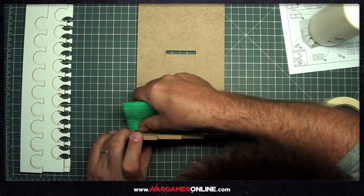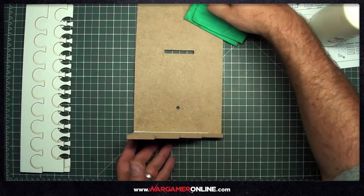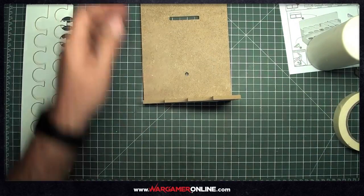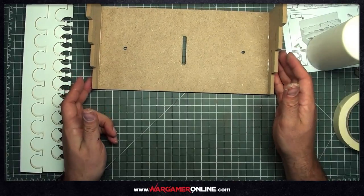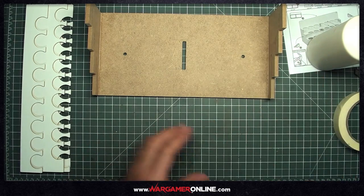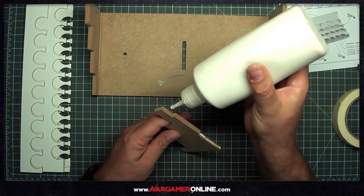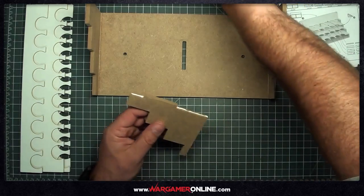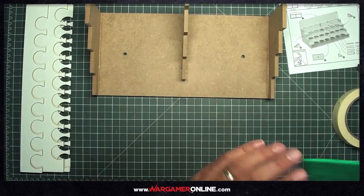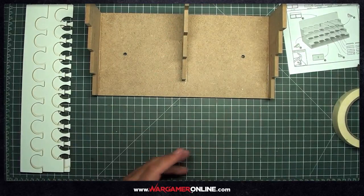That's just a temporary hold at the moment, so don't worry if it's not absolutely perfect. Just use a damp cloth to wipe off the worst of the glue and move on to the next side. After repeating it on that side and a quick wipe down, everything's done on the sides. I'm not too worried about whether they're exactly 90 degrees — those first two bits of tape are just there to hold things while I get the main structure together. The centre support only needs glue on one side since it's only a vertical secure and all the weight bears down on it.